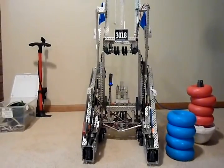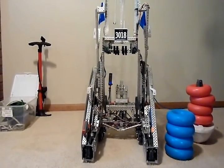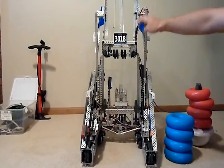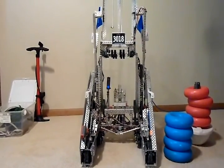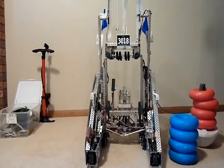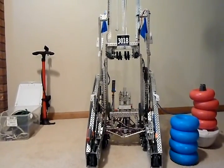In addition to the chain and offsetting the arms, we also loosen certain points of contact between the arm and the cage in order to provide some tolerance when we pass over the center. Even if it tips, it'll still snap through the top.